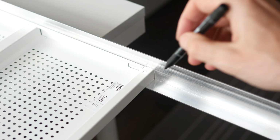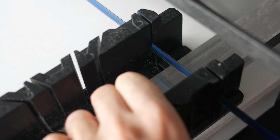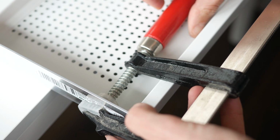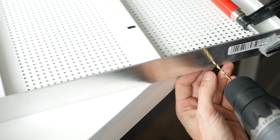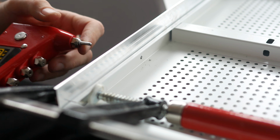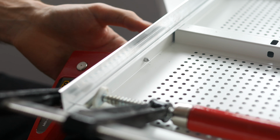To combine these together, I used an L-shaped profile cut to the length of 2 shelves and a number of rivets. Riveter is actually one of my favorite tools, and using it is easy peasy. Simply drill a hole in both surfaces that you want to join, load the rivet into the riveter, put the rivet into the hole and apply pressure until you break off the stud.